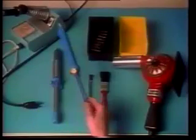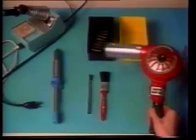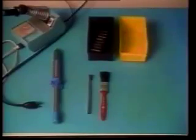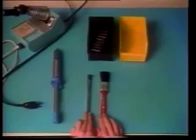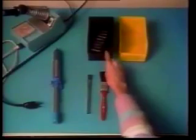These old blue ones can generate several thousand volts on a dry day. Be careful of heat guns. Some can generate over 10,000 volts directly on your work. And don't use toothbrushes to clean your work. Brushes should be natural bristles, not plastic. And storage bins should be made of conductive plastic.